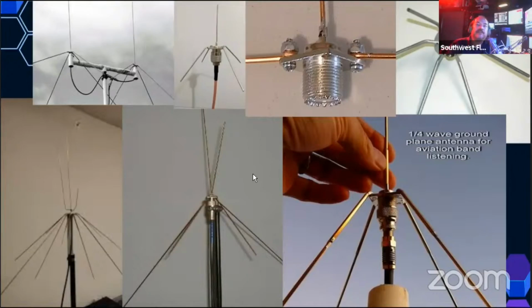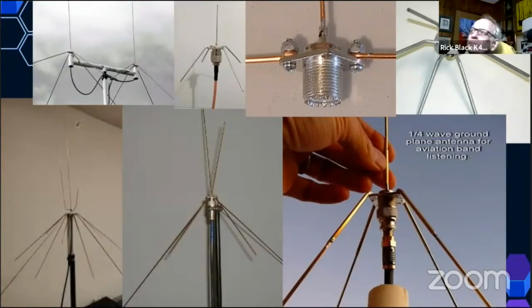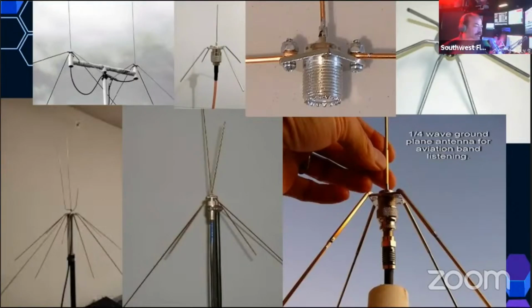All right, so those are all different ones of those. But this is one of the easiest antennas to build out there. And for 220, you can build this for 220. It's like 10 or 12 inches tall. 13 inches tall. Yeah, and each of your legs will be 13 inches. So you're talking about something pretty small, something that you could literally put on the end of a broomstick and just walk outside and stick it in your yard for 30 minutes while the buck and a quarter net's on. And then just go grab it and bring it back in.